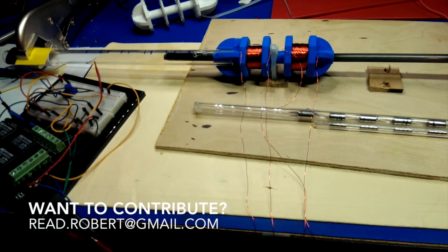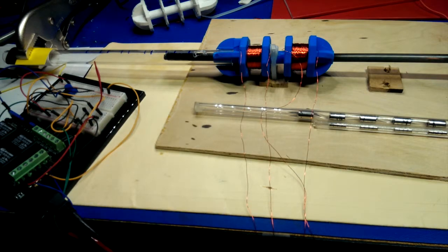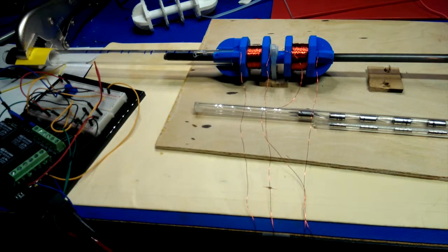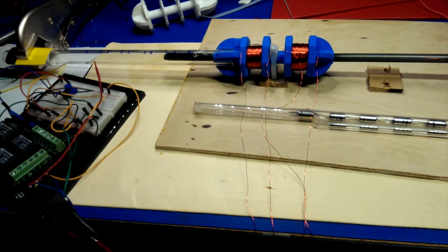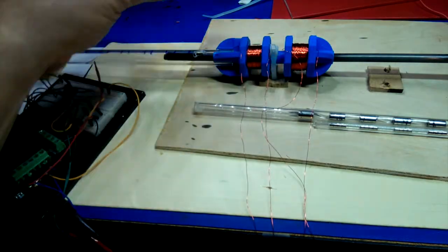It's actually a little tricky to design coils. I'm writing a little paper on how to do that. Basically, you choose the magnet wire diameter to stay within your amperage limit, depending on what you're doing. But since I moved to these smaller wires, I haven't had any problem with them overheating or drawing too much current. There's a relationship between current and number of turns that you want to balance in some circumstances. So I'm pretty happy with the 3D printing part now that I got it done, this part here,